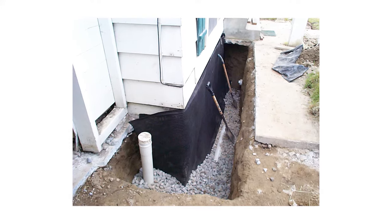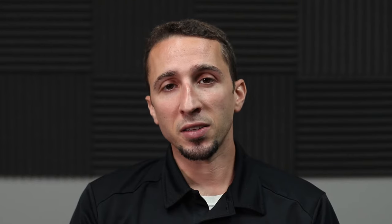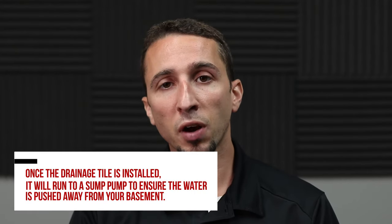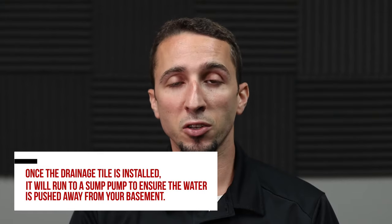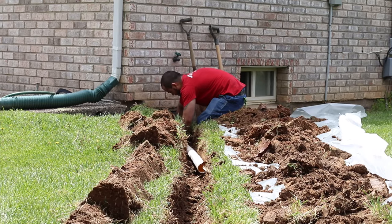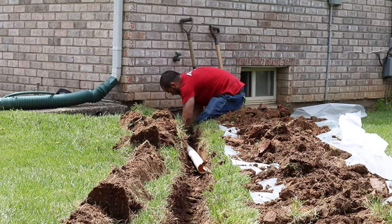The first option we're going to talk about is exterior water drainage. In this option, we have to remove all of the soil, all of the grass, some pieces of architecture — maybe a deck — in order to expose that exterior foundation wall all the way around the house. The foundation wall is then cleaned and sealed with a tar mastic, and then there's a plastic coating put over the top to preserve that tar mastic. Then a drainage tile is set at the footing, sometimes with pea gravel around it, and that drainage tile is routed to a sump system inside the basement, or to an area with extreme fall to push the water to a different location.